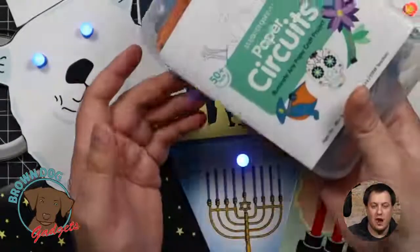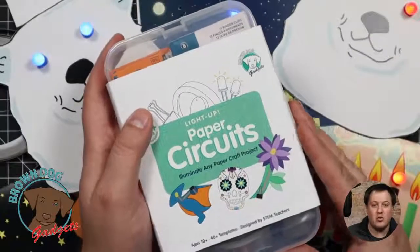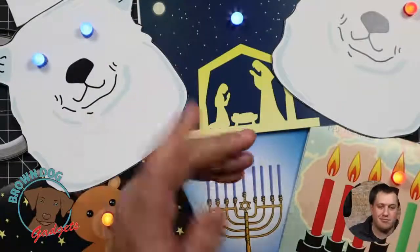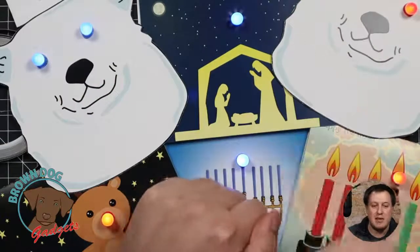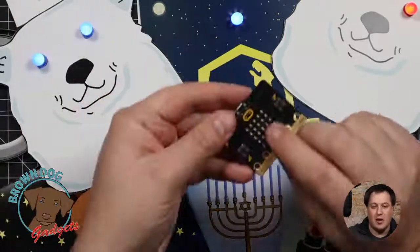So anywho, we just highly recommend using the right tools. Yeah. The right tool for the right job. That's always what I say for education things. The right thing for the right job, and everyone is happy. If you skimp out, just seriously go with the Maker Tape, if nothing else, and then try to go with the 10 mil LEDs. They're so much better. And never, never, never, no matter what anybody tells you, never try to use little tiny surface mount LEDs.